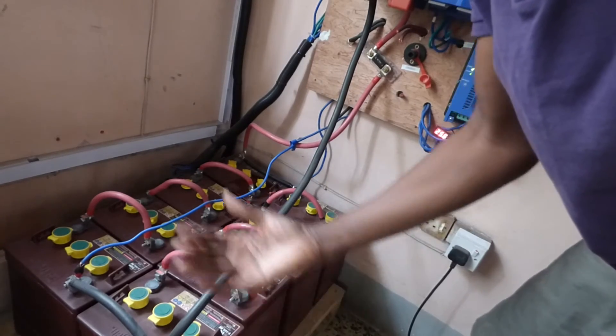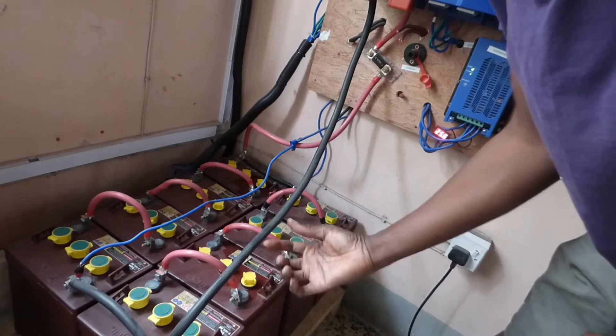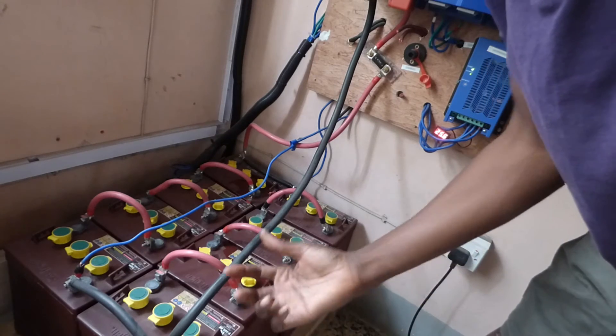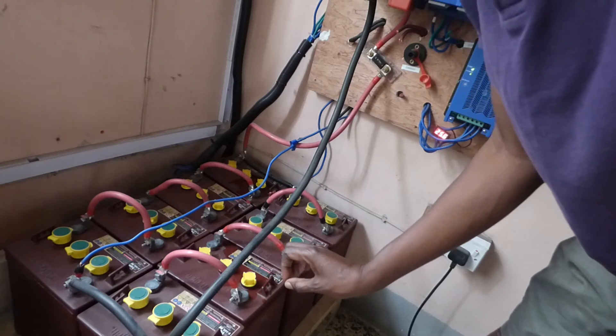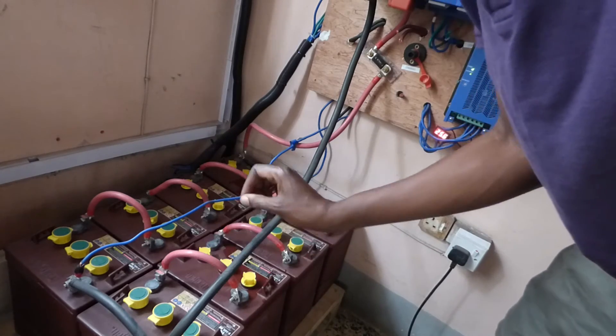Because what's happening is, as the battery goes through the charging and discharge process, it turns the electrolyte — which is your distilled water — into acid. You want to dilute the amount of acid inside your batteries, and that's why you put distilled water in it.